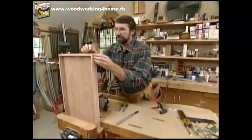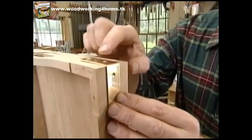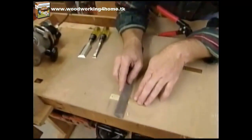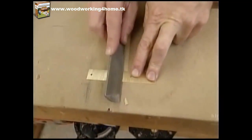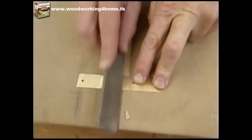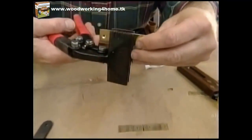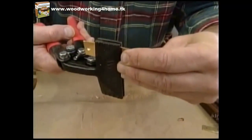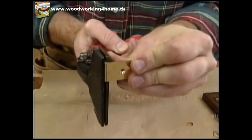Before I mortise the corners of the tray for the L-angle brackets, I have to bend them. To get the sharpest corner, the best approach is to take a file, hold it at 45 degrees on the back side of the brass, and keep running it through until it's about halfway through the thickness. Then I take a pair of smooth-jaw pliers, line them up on the score, and bend into a nice sharp corner.